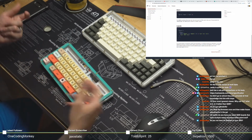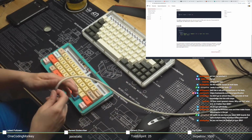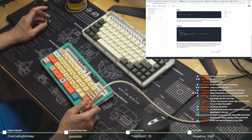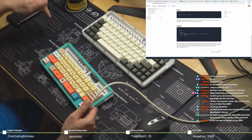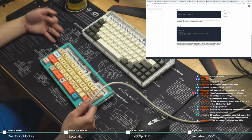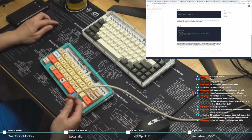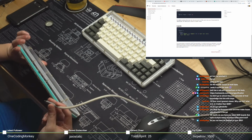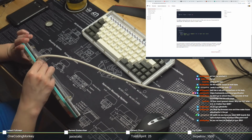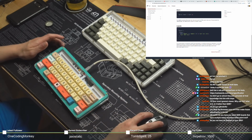VIA is a GUI for QMK, so your board is still running QMK. And the main difference is that instead of storing your key map in Flash, VIA allows you to store your key map in EEPROM, allowing you to actually change key maps on the fly. So as a quick example of that, let's do, let me just set this up.